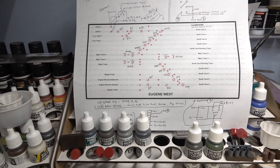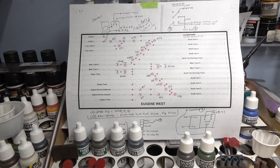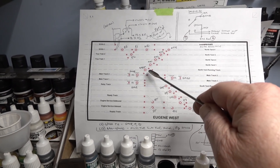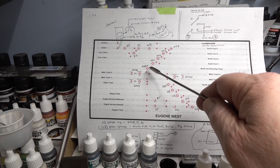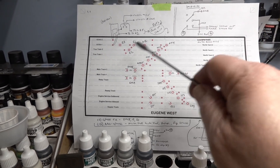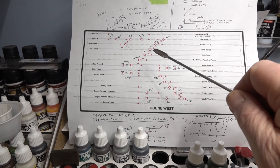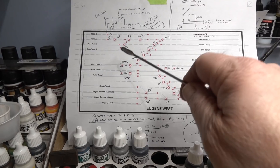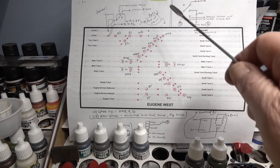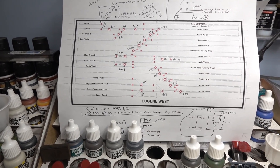For the toggles I have to do the wiring and soldering. I thought I'd solder them in groups on the bench, leave pigtails long enough to reach where they need to go. I'll have to bring in the LED leads and solder them out at the cabinet, but that's okay. The leads on the LEDs are long enough - I'll solder them to the switches when I'm out there.